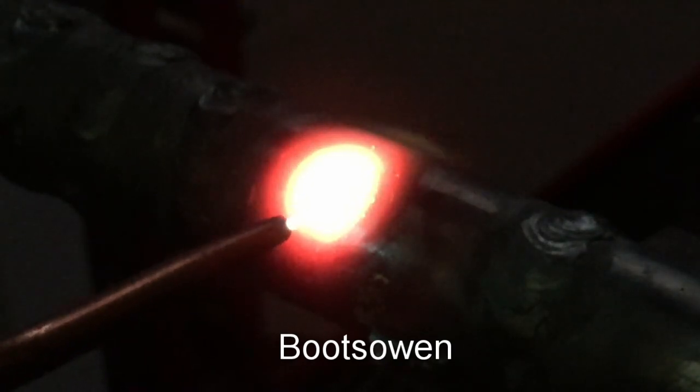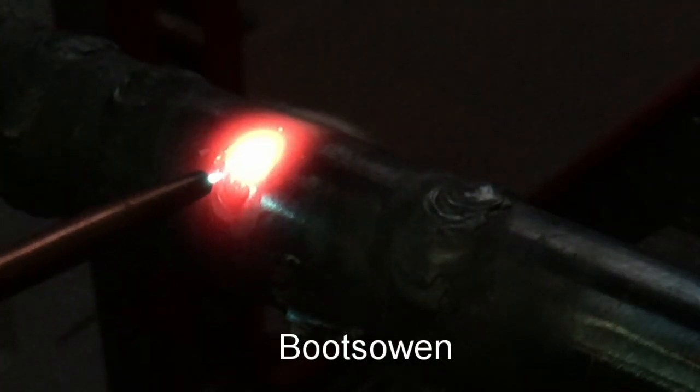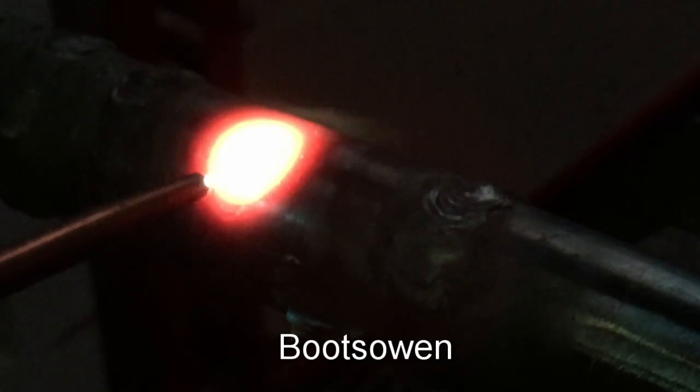You can see there — the only way to describe it, I've seen in the book — when you've got it right, when you've got the mix of gases right, it looks like a little pool of butter. My weld pool there is about six or seven mil in diameter. Looks like a little bit of a hole formed there — I would have to fill that up with rod. I'll do the next run with rod filler. I'm probably at a bit too steep of an angle. I could probably turn down the gas and have a tighter angle with the flame more like that.